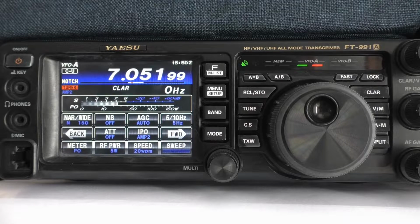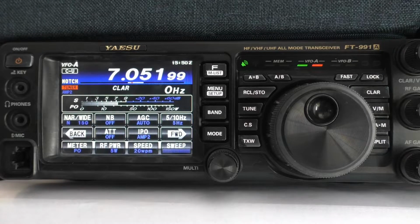Automatic gain control, or AGC, is a circuit that senses the received signal strength and then limits the gain of the RF and IF stages to keep the output audio volume at a more or less constant level. AGC also protects the RF, IF, and DSP stages from overload, as it limits the signal strength that is allowed to flow, irrespective of that signal level.